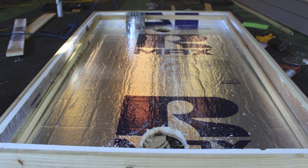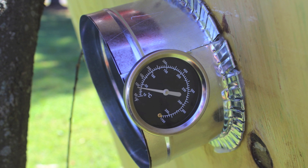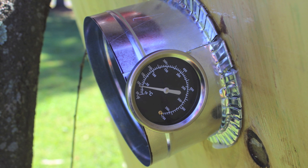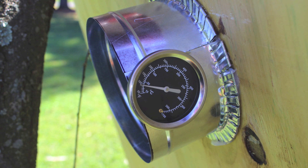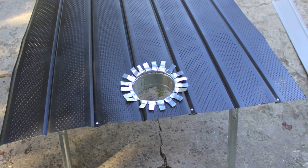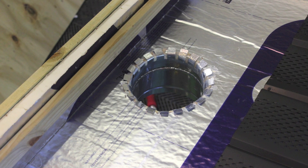Then it was time to drill our two six-inch holes — one on the top and one on the bottom for our entry and exit. I went with six-inch sleeves rather than the four-inch I see on many solar furnaces out there. With a larger six-inch sleeve versus four, you can move more air but also do it at a slower rate, and when you do that you get better heat transfer — if the air moves slower across the absorber, it can capture more heat. If you want to go smaller, you can always add a reducer as an afterthought. The bottom hole pierces through the soffit material so cold air from the house gets against the glazing, and the top hole is behind the soffit material so the hottest air that's risen up is as far from the glazing as possible while still touching the soffit.